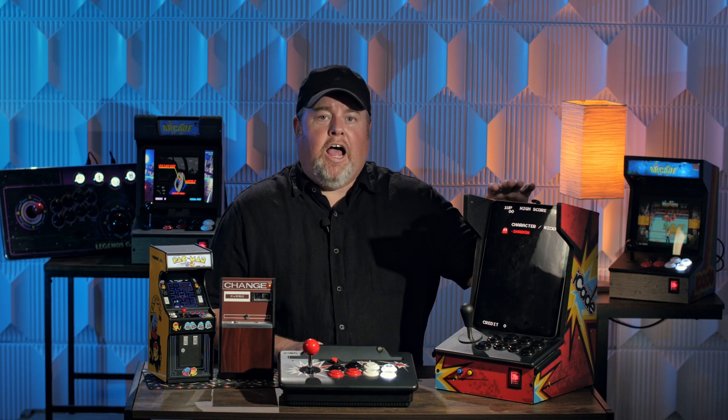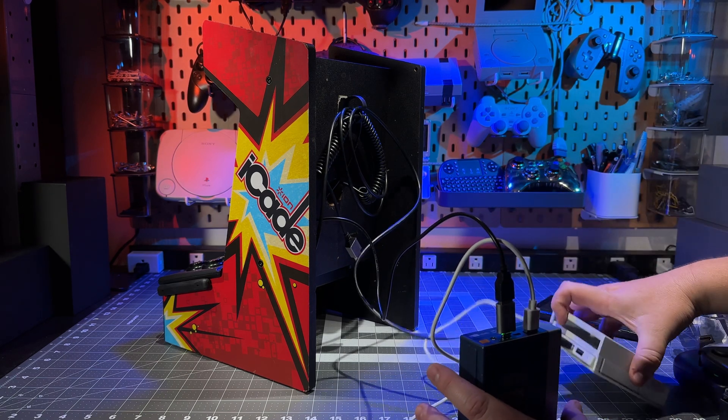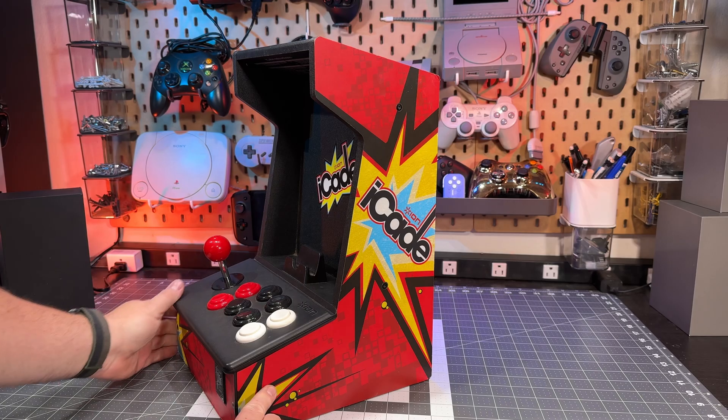What's great about using an iPad with this iCade system is that the iPad has its own power and its own speakers — it's the display, so no batteries or extras are needed, and it doesn't need to be plugged into a wall. We can even hook up HDMI into the iPad and run the Switch externally, controlling it through this control panel in multiple landscape or portrait modes. Let's take a look at how this iCade unit was torn down and rebuilt with a Switch encoder board.